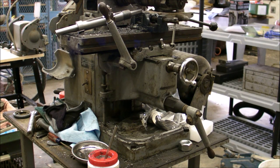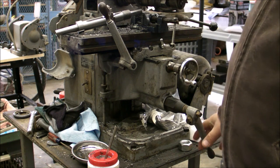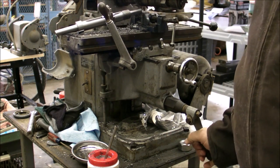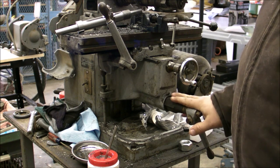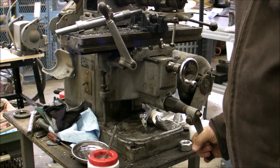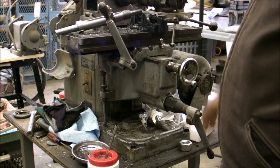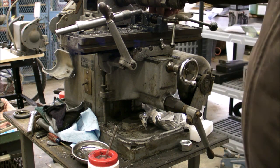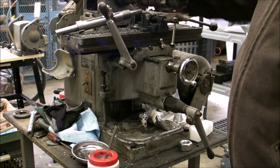Also, I thought I'd show you real quick the swing arm, because I don't know if I kept the other video I shot the other day. Right here is the arm for raising the knee up and down — this is how this knee is currently set up. I've got another one that has more of the traditional hand wheel mechanism on it. It was a little bit more difficult and a little less precise, but I was using this to take it up, and when I touched off I just had to continue — I used my long five-inch dial indicator mounted up here, indicating down on the knee, to move up the eighth inch I needed for the depth of cut.